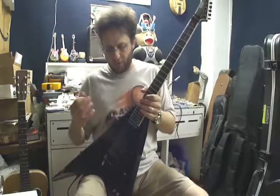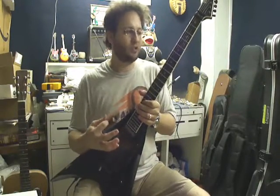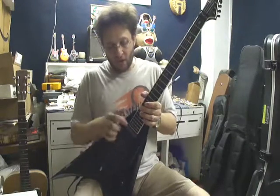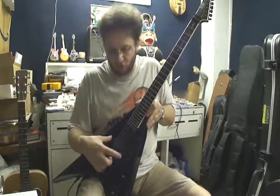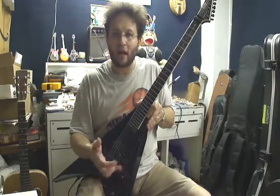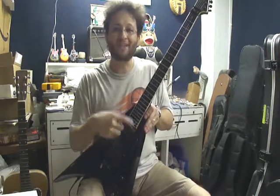It's a cool unit. It definitely has its applications, especially if you want those violin bow type sustains, similar to an E-bow, without having to use an E-bow. You actually install this. It can be installed a number of ways. Since he primarily only ever uses a bridge pickup, he didn't really care to have a three-way toggle switch like is recommended in the wiring diagram options, where you could also have it function as a pickup as well.